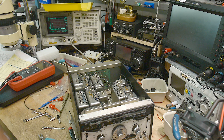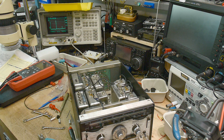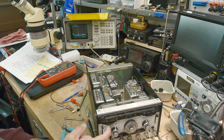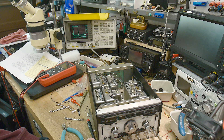This is external leveling. If I turn on external leveling, of course it's not leveled — it just goes wacko. Maybe that's a clue. Is this switch funny? I'm rattling the switch and sometimes I get a little spike out there. Maybe the ALC is a bit wonky — I think that comes out of that same unit. Improvement, but I'll need to investigate some more. That event is completely random, so something else is going on.